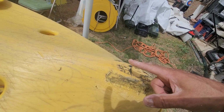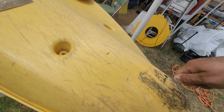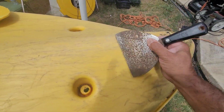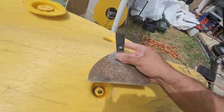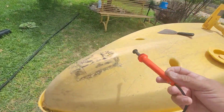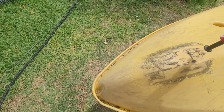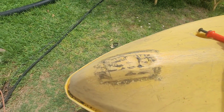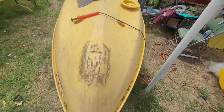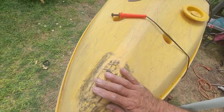The problem with the point on it is that the tip of it is slanted. You think, well, that's good to get into the corners. The problem is you're going to start pressing with it, and the tip will bend up, and if you try to straighten it out, it'll snap right off. After about 30 minutes of use, I bought a Harbor Freight one, and then I also bought one of these. This is a Weller. Weller's a good brand. This is a Weller wood burning kit. You see how the tip is flat on this one? I can put as much pressure as I want, and I'm pushing straight down on the thing. I'm not pushing at an angle. If I was to push at an angle, the tip breaks on it. That's what happens with the Harbor Freight. So after about 30 minutes of use, it was destroyed.